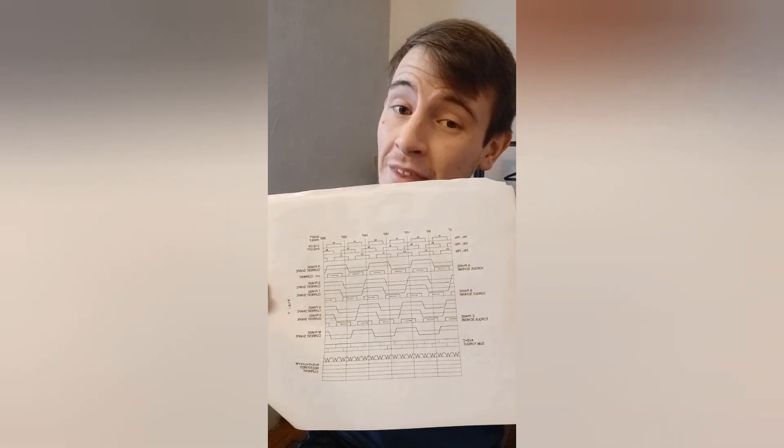The rotor consists of six magnets, and it's also used in three specific circuits: one is called a velocity encoder, a commutation encoder, and a photosensor. If you synchronize the phases just right, you should get a wavelength output looking like this on all six phases of your output. So this is a six-phase generator, not a three-phase on top of that.